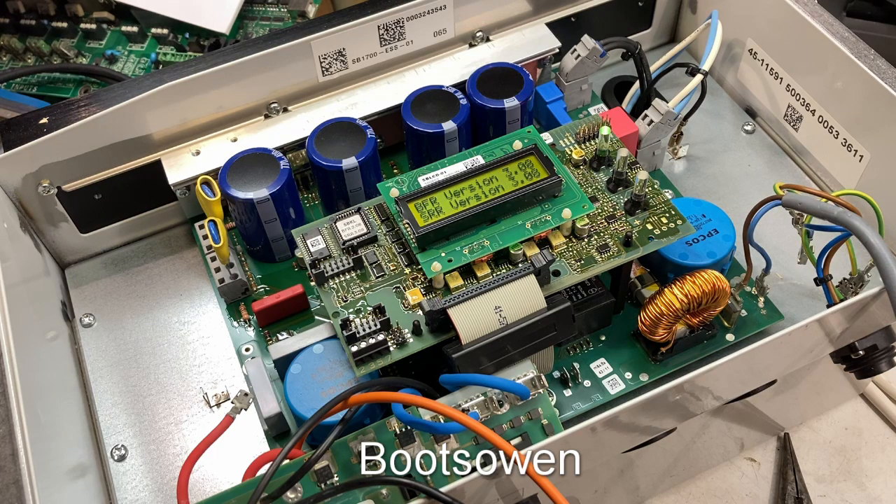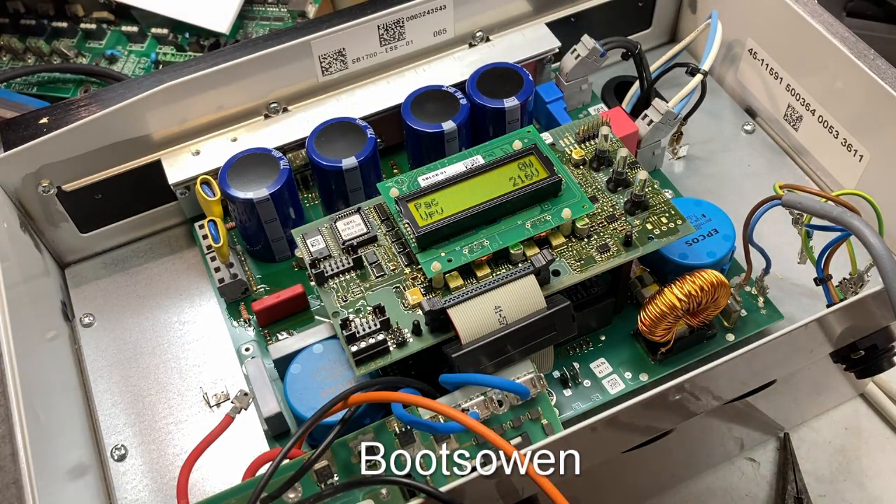We're off — green flashing light. BFR version 3.08, SRR version 3.08. This is GB/G83/1-1, which means it's set up for here. E today: zero kilowatt hours. Mode offset. PAC is zero watts. VPV. E total: 13,838 kilowatt hours. Mode is waiting, so it's going to start up hopefully — green flashing light. I've got 215 volts, that should be enough to kick it off. H hours total — still waiting. The start voltage on this is 139 volts, so it should be within range — it's kind of bang on the middle. 42,982 hours — it's well used.